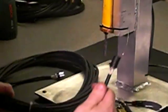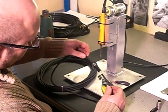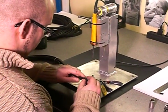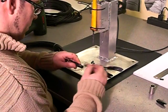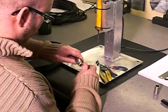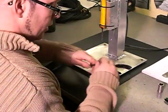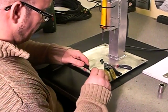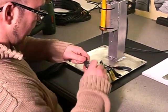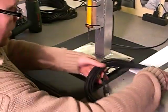When you join these together you can see the opposite. Take your cable clamps and your boot — slide your barrel over and bring your boot down. Same again, put your cable clamp on, take your barrel, slide it up and bring your boot back down and screw it up. And that is a 10-metre mic cable in five minutes.